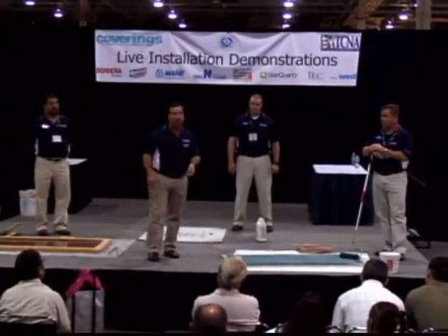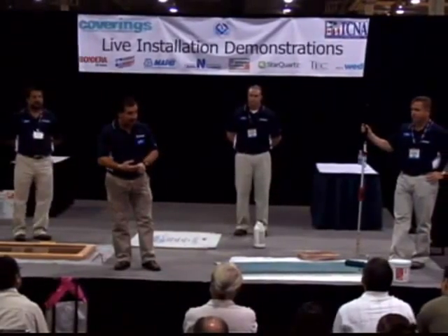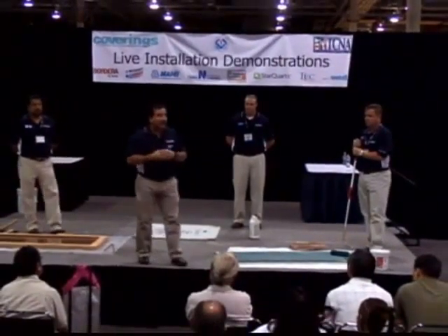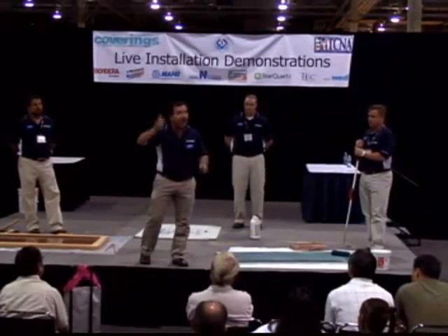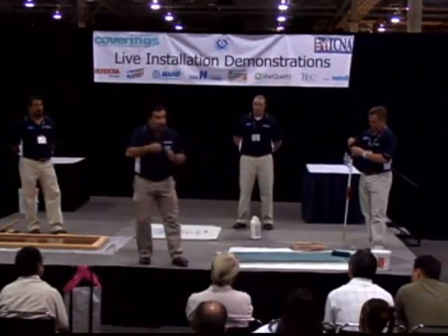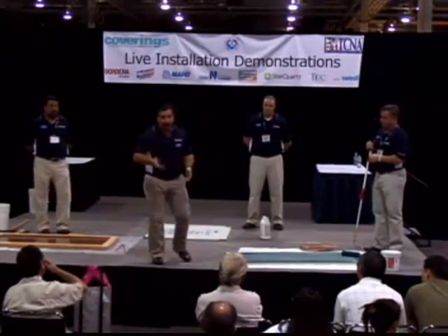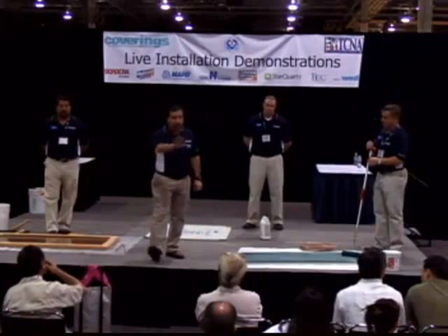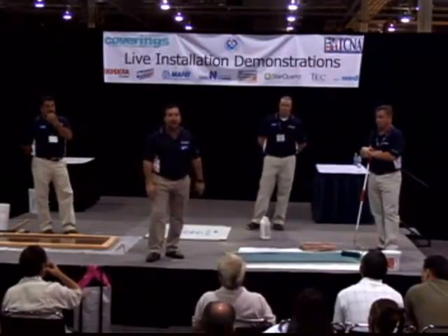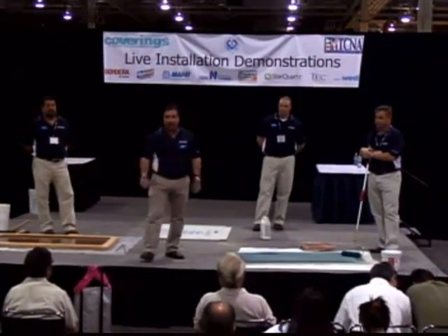Good question — is it vapor permeable? Water is an amazing little creature. It comes in three forms: a liquid, a solid, and a gas. In liquid form it's the water coming out of your shower; in solid form it's a block of ice; in gas form it's the steam generated by hot water. Steam rises — it's lighter than air. The particulate of water in steam is way smaller than the particulate of liquid water for waterproofing purposes. It is vapor permeable right now — vapor can rise through it. It's not a vapor retarder. A true vapor retarder is probably going to be an epoxy. Make sure you don't have a vapor issue before you put this down, or it will blow it up off the floor.